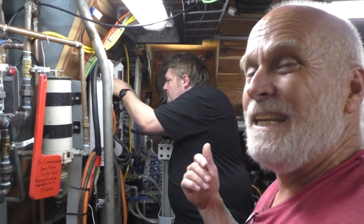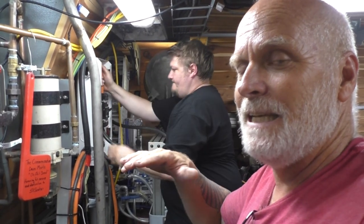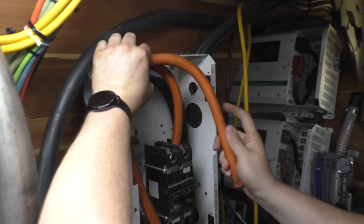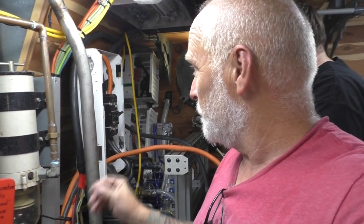Mr. M is working on our DC breaker panel. This is the connection between the AC and the DC because the DC battery supplies power to our inverters. It goes through these massive four-gauge cables and through those DC breakers, then over to the inverters. The breakers and the inverters are all a donation out of Wisconsin — somebody at Y2K thought the world was going to end and prepped for it. God, I love those people.